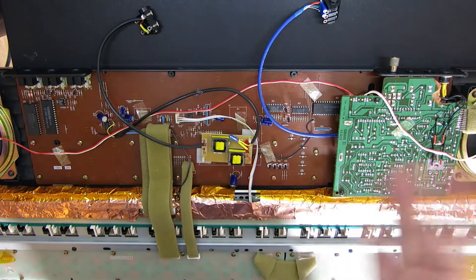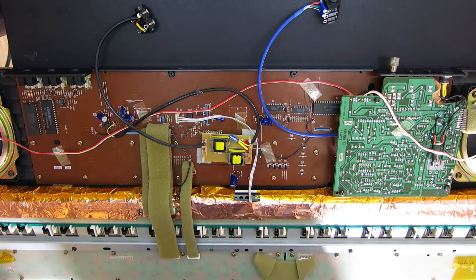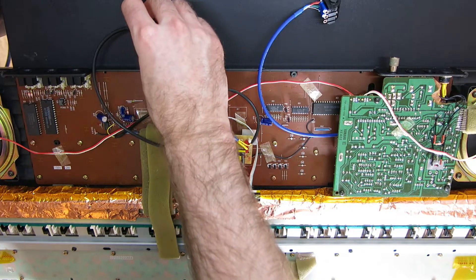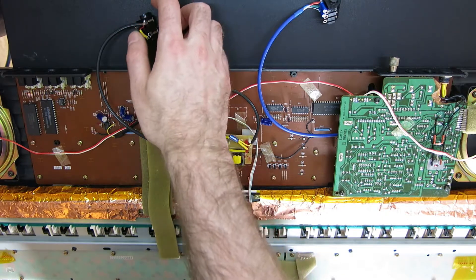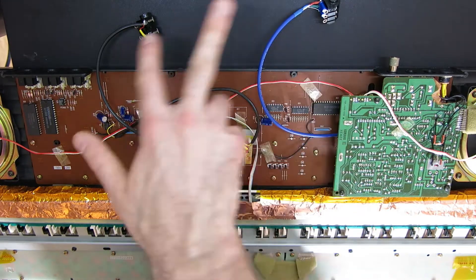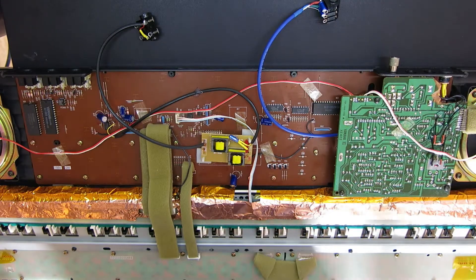I'm aiming to use this for quite hot input audio interfaces and compressors, so it should drive any +4dB line level quite easily. If you want to drop it down, you could probably put a higher value resistor on the output side, which should generate less noise, but I'm happy to attenuate it later on. I could have low-passed these with just a little film capacitor across signal and ground, which I think does happen in the amp board, because the output is noticeably brighter and cleaner from both of these. But I thought I'd leave it at full whack and attenuate with studio gear as much as I want — a nice clean, sharp output. So next: let's put it back together, take it to the studio, and record some demos.